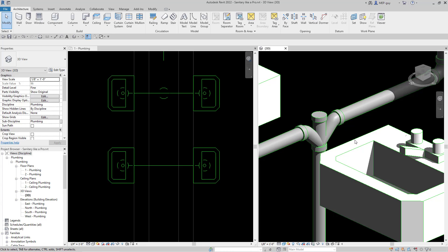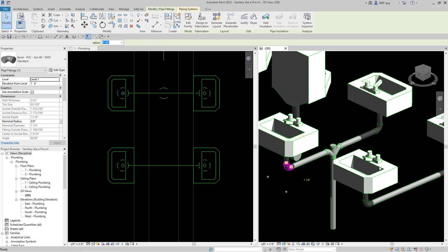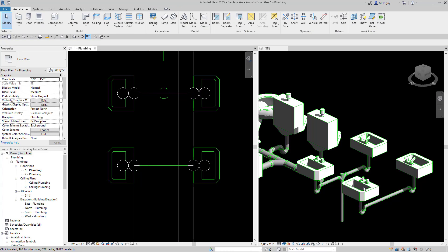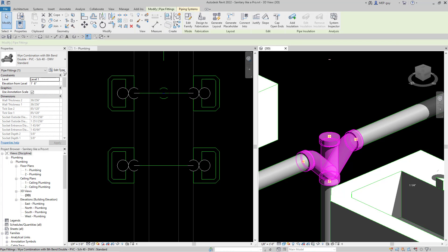This is actually not a legal fitting. When we change these to P-traps — since these are my only elbows in the view, I can right click and go to select all instances visible in view, which selects all my elbows, and quickly switch those to P-traps. You'll see in this view all of my P-traps are showing correctly. The reason the fitting isn't OK is because the trap weir connection at this point is actually lower than that weir, creating a chance for siphoning effects that might pull the water out of the trap. So we have to change this fitting to a regular double sanitary tee — that is the correct fitting to use.